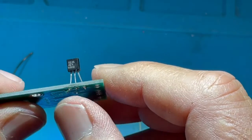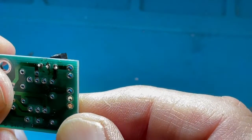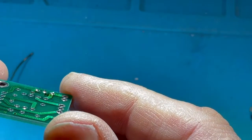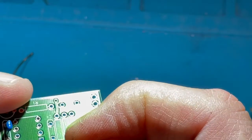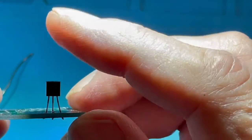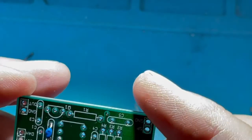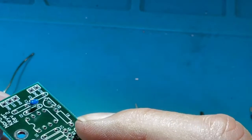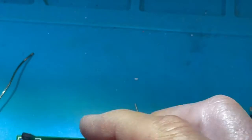In fact, I have removed so much solder that I can nip off further of the leads. Be sure not to take off too much solder, but you can tell by the quality of the pad that things are soldered just right. I normally put my components a little bit lower onto the circuit board, just by pushing the components in; in this case, for demonstration, I'm not. The last thing I'm going to demonstrate for this board, before I finish it up in a real quick manner and show you the results, is the integrated circuit.